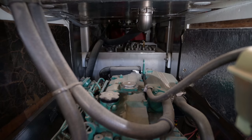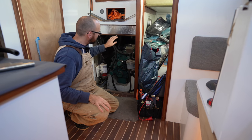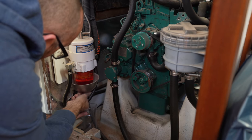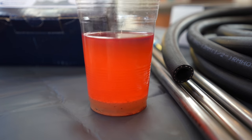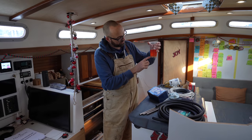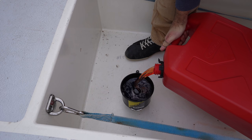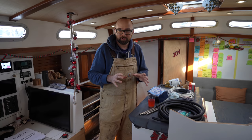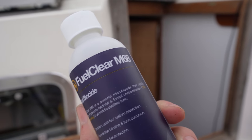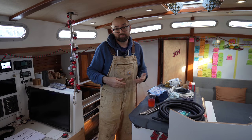Hiding behind our Volvo D240 is a 180-liter day tank. All consumers on the boat — the engine, the genset, and the hydronic diesel heater — are all connected to that tank. I'd like to make sure the diesel in that tank is as clean as possible. Despite the tank only being a few years old, a few weeks back I noticed some crud in our filter and water separator. There's definitely some yucky stuff going on — we've got a bit of water in our tank. From now on we're going to start using a Racor deck fill filter so that diesel goes through the filter before it enters the tank. We're also going to start using a diesel bug additive to kill the bug, because if you have water in your diesel you can get diesel bug — black sludge in your tank that will eventually clog your fuel filter and leave you without a working engine.